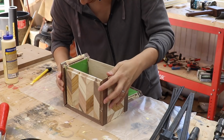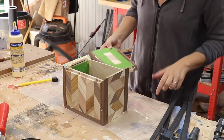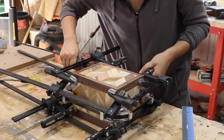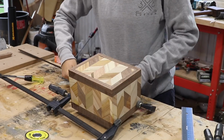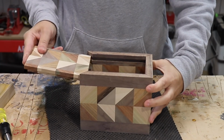The next box has a regular fitted lid, so the lid gets glued into place during assembly and the inside gets completely closed up. So I lined the inside with tape to help with cleaning it out from the squeeze out once I cut it open. But I'm a really messy gluer, and I think I should start getting into the habit of pre-finishing with shellac instead. Moving on to the lids. The sliding lid is easy to do.